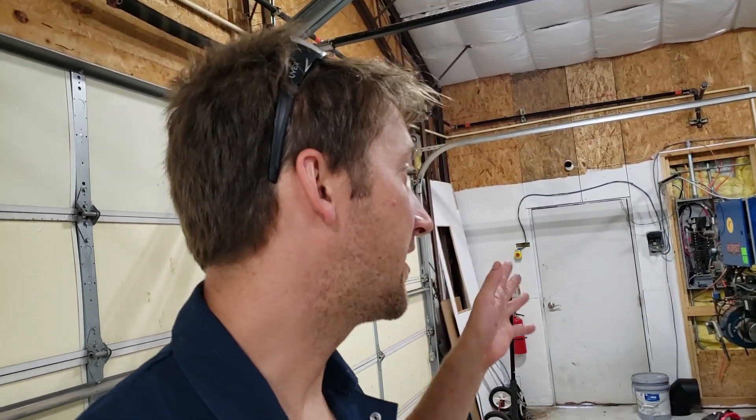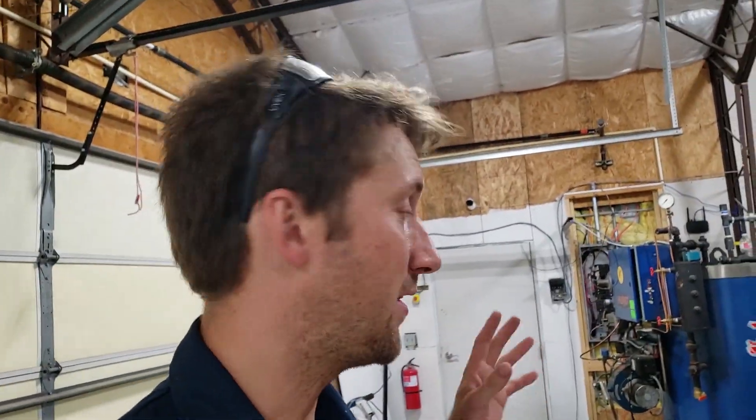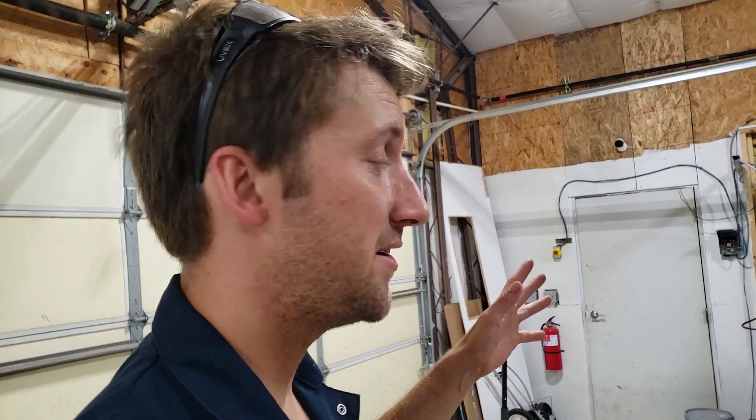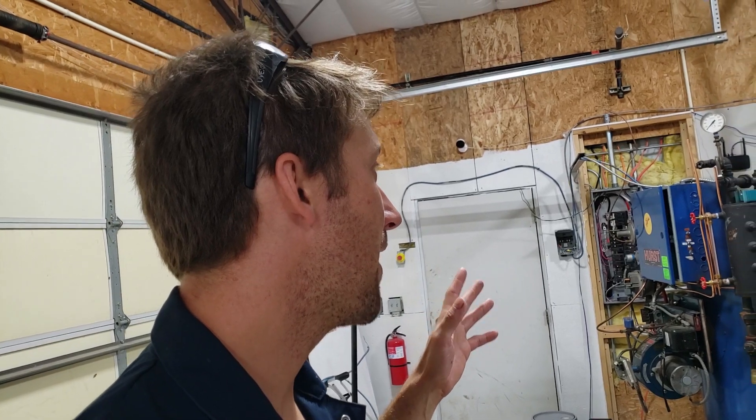Let me go into expenses — I'll probably have a full breakdown in the future. Right now it's $80 an hour for the laborer guys, and there are two guys there today, so that's $160 an hour. All the parts add up — just the regulator alone was like $500-600. Safety reliefs have to be updated every two or three years and they're about a thousand dollars altogether. On top of that, I have to keep up with state inspections annually, and there's actually a biannual inspection as well.